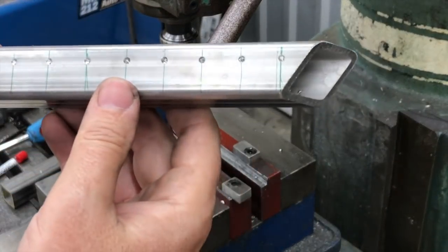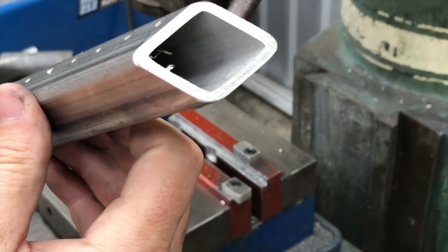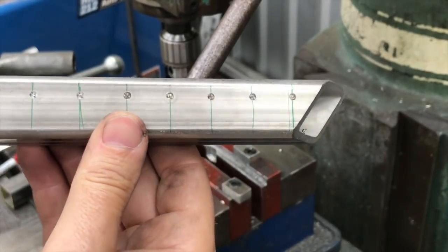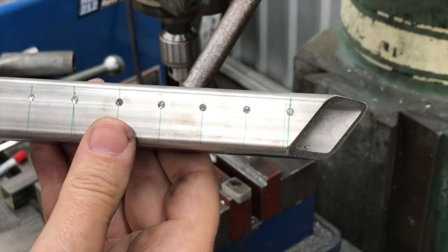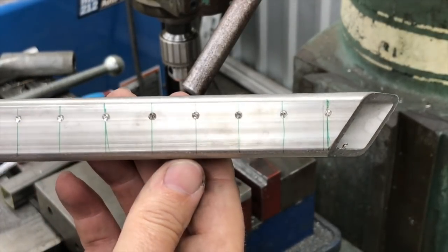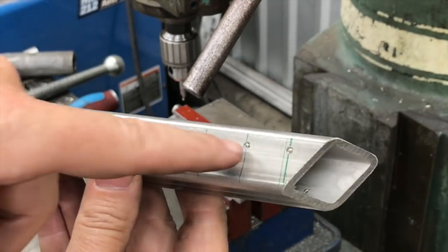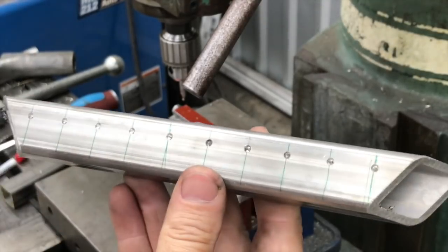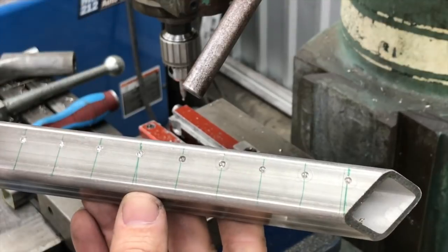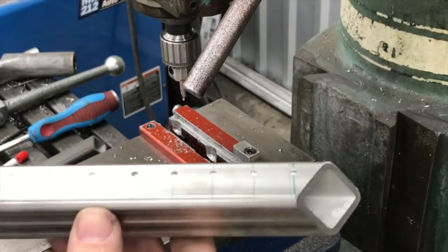I didn't go all the way through. This is 120 wall thickness here, so I went maybe a hundred thousandths in, and it's a hundred thousandths hole. Those just end up being a catch point for our next step, which is going to be to fill it with Inconel filler wire. I did this dry and I've already cleaned everything off with lacquer thinner — it's prepped and ready to weld, no cutting oil or anything on it. This operation I do dry; the next operation will have lube on it.